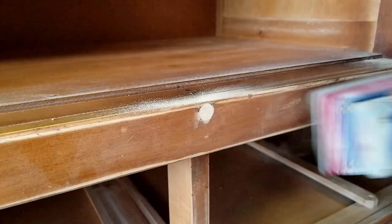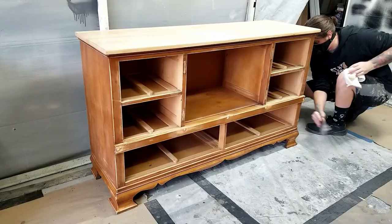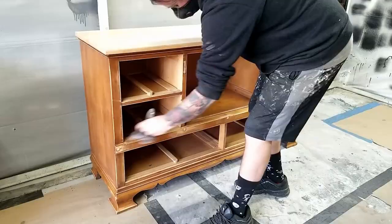This piece also had these round buttons or dowel ends on the front that kind of looked dated to me, so I took those off, wood filled them, and sanded them smooth. With the majority of my prep work and repairs complete I can finally wipe this piece down one more time and get it ready to be painted. I like to use a brush and a dry rag to dust everything off first and then come back with a damp rag to get any leftover dust, because if you start with a damp rag and you're mopping up a lot of dirt you run the risk of smearing it around.